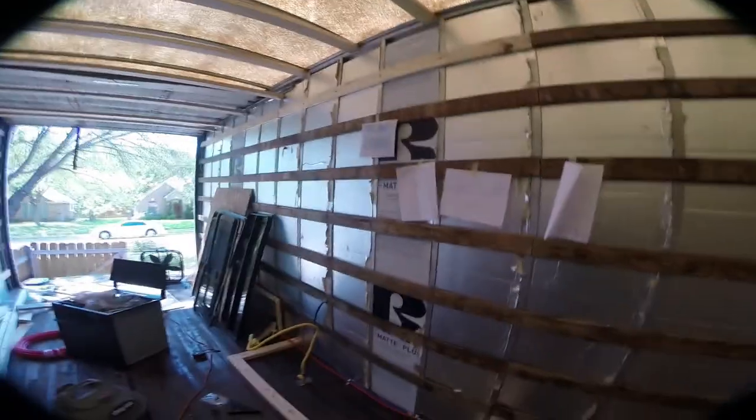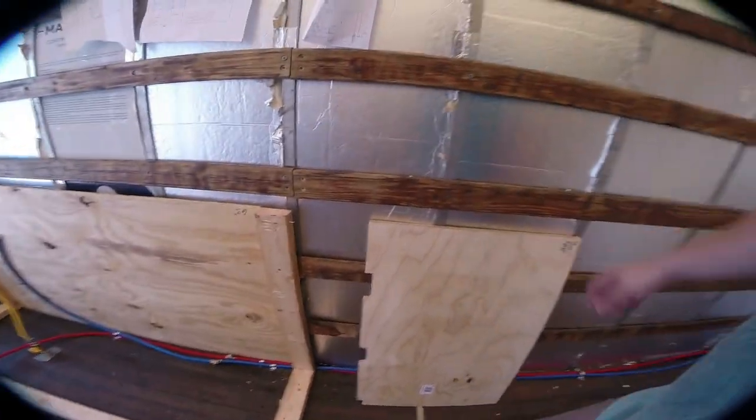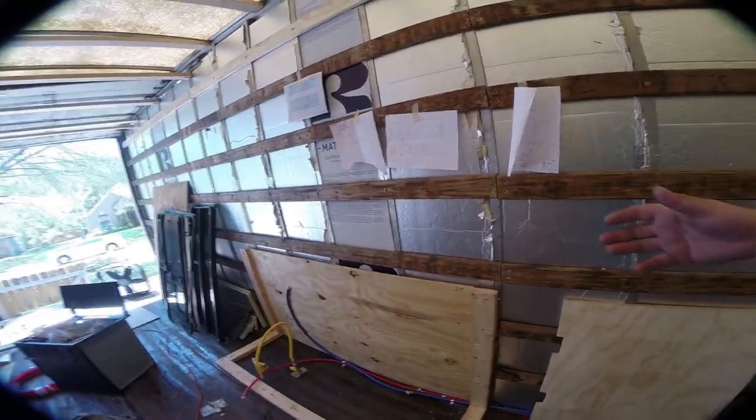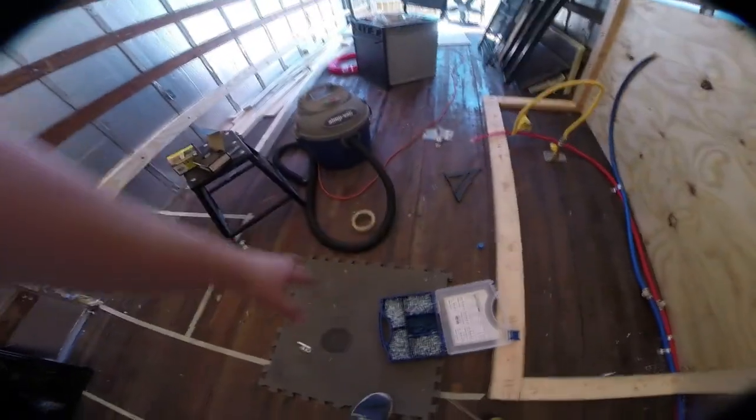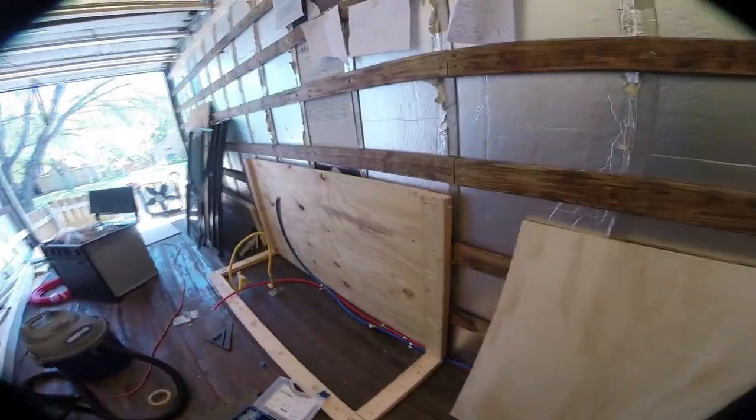Next we're gonna cut the back piece — a quarter-inch sanded plywood piece that's going to go against the back wall. Now that we've got one board done, let me show you — this is nice birch sanded plywood. It's kind of expensive, but I spent probably 80 or 85 dollars on wood just to build this, and one cabinet costs over a hundred at Ikea. The screw goes right in here — the coarse ones are for plywood. You can see that this is the correct length because the top of the screw isn't going to poke out. We'll put in all these pocket screws and it should be dead nuts solid.